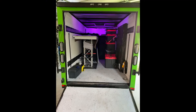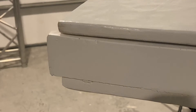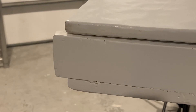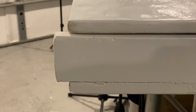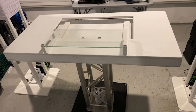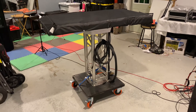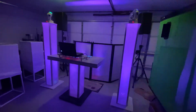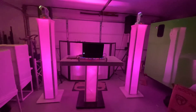I take another tie wrap and tie that to the easy track to lock the unit up against the wall. One thing you'll notice is I left an extra inch on both sides of the unit, and this serves as a bumper when the unit goes up against the wall and gets transported in a trailer. This works out really well. In any future design I build, I'm always going to include that extra inch — it protects your unit, protects everything, doesn't take away from the look, and no one ever notices it. But it's that little extra ingenuity that will make this last a long time.